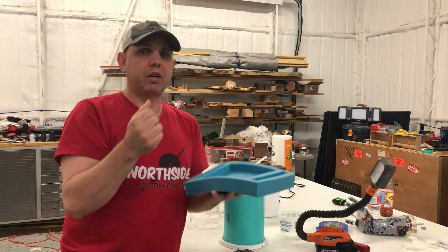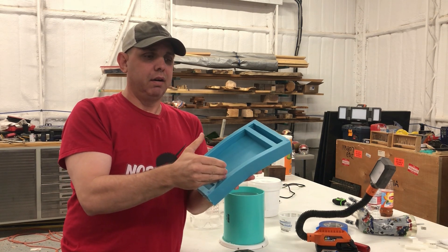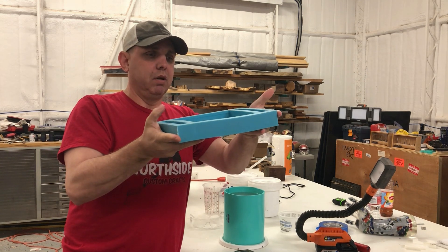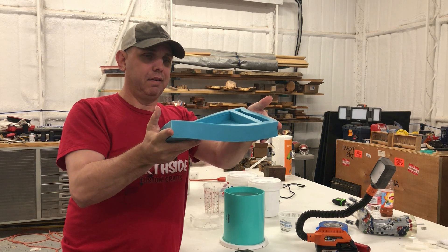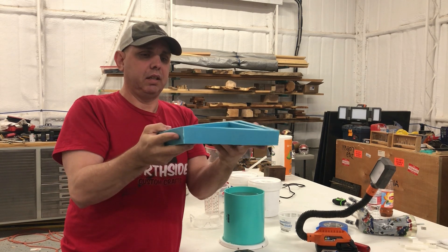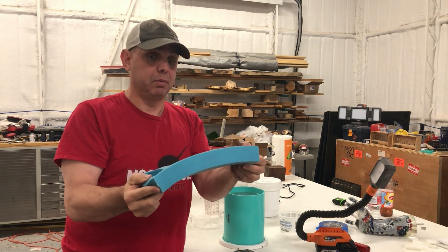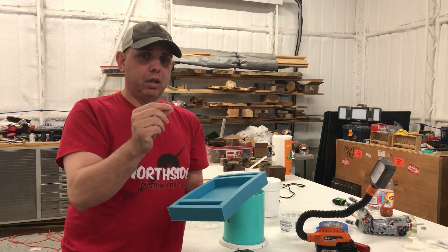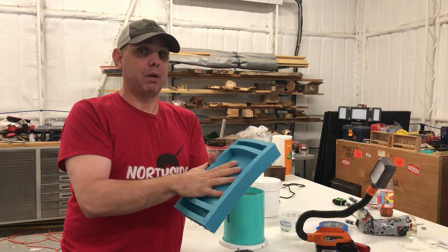The other thing is if you're going to use a pressure pot — and this goes in a pressure pot — if this thing is full of air and I put it in the pressure pot, the pressure pot is going to try to squeeze all these bubbles and it's going to deform it. So two reasons: if you use a pressure pot, you need a silicone mold without air bubbles. And if you're trying to capture details on a skull, a heart, or whatever it is, you don't want air bubble details — you want the details of the figure you're trying to duplicate. That's why we need to degas.